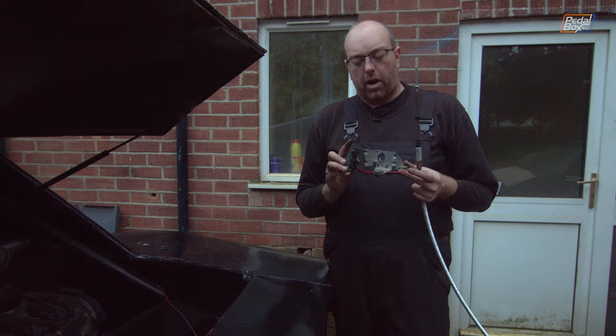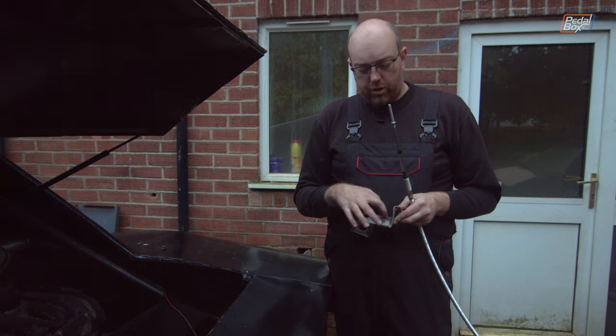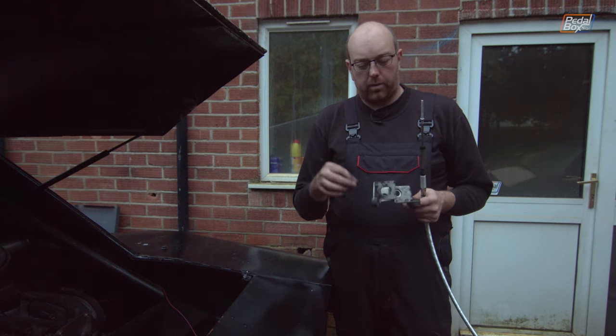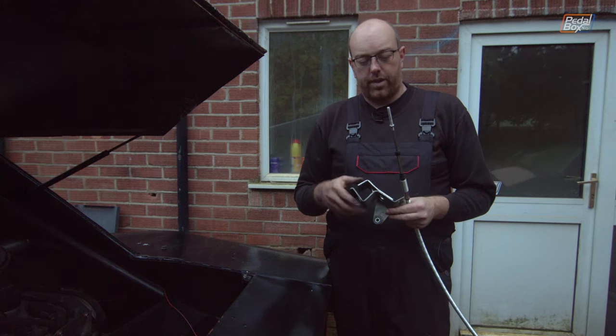Here's our control cable bracket that we took off the gearbox, and I've added this little plate on, a couple little tacks, and some 16mm holes. This one goes through the original point on the left. This one controls the forwards and backwards. This is the one that we're having trouble with, because there is a good inch and a half that we can't use, or we can't mount to with this cable.